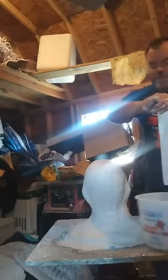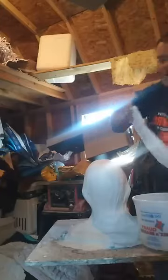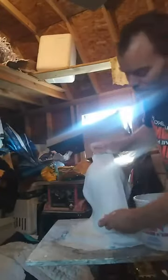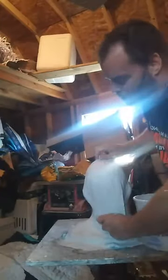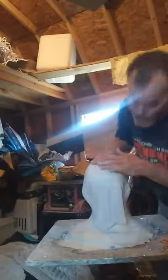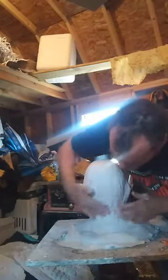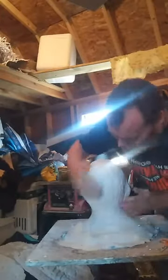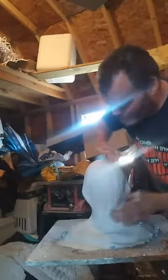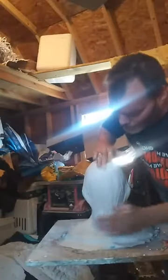Like I said, all I'm doing is taking the bandage, dipping it in the water, gently running it down. You're not squeezing the water out. You're letting it run off. And it's only a little bit. You want to leave as much of this on here as you can, so far as the plaster, because if you take the plaster off, it's just a stupid piece of cloth. Doesn't have any strength or anything. So,